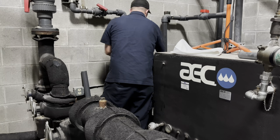There's a plug aptly named 'air pressure alarm' — we just plug that in and it runs off a pressure regulator on the bulk tank. That electric switch turns on a contact if pressure drops below 90 psi and activates the alarm and buzzer on the other side of the wall. Now that's all done except for greasing — sorry for screaming, I'm half deaf. The only thing left in here is to put a couple pumps of grease in the motors and we're on to the next thing.